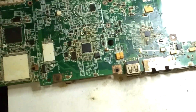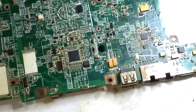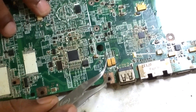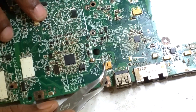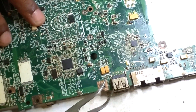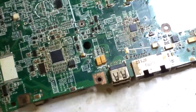Today we are going to show how to remove a capacitor and how to solder it. This is a polarity capacitor — the line indicates the positive side and this one is the negative side. You have to be careful because if you change the value incorrectly it will bust. That's why we do this process. This is the positive side and this is the negative side. We will do the removal process without using an SMD soldering workstation.